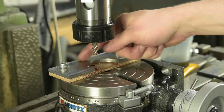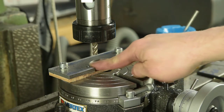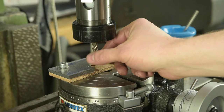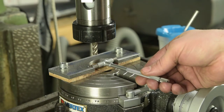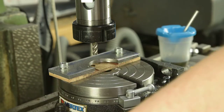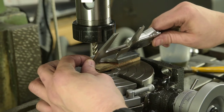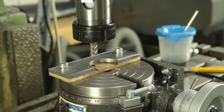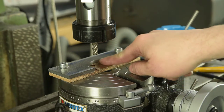So next is to do a similar thing for the outside radius. In fact, next is to measure this and correct this inside and take the remaining material as a climb cut. I can't really get my telescoping gauges to work properly in here without a bit more length of bore. So I set my calipers to 50 and it looks like they just go in with no play. So I think it's on size. So I was going to do a clean-up cut on here and I don't think I will. I think I'll just clean that surface by hand with some wet and dry paper or something.